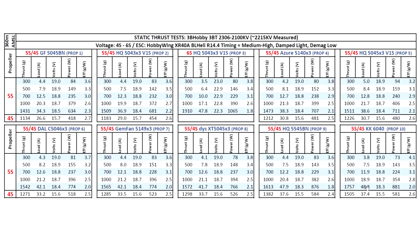The 48 amps seems manageable - these are burst amps, so you'll only see them for a very short time. Also remember these are static measurements, so they'll be higher by about 35-40% compared to in-flight. When you're in the air, these amp numbers will be lower by that much. All the amp numbers here seem to be within manageable levels, so any 30-amp ESC should be able to run this motor on 5S. The motor seemed okay on 5S and wasn't bogging down or running excessively hot on short bursts.